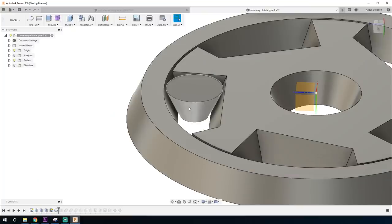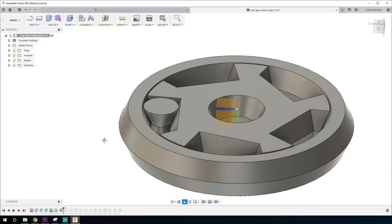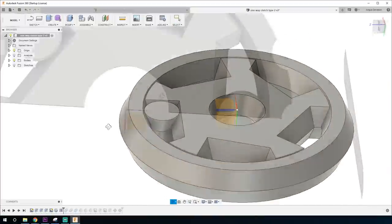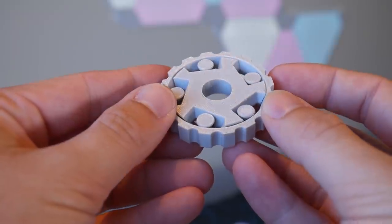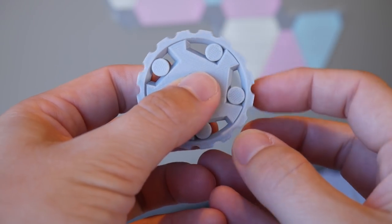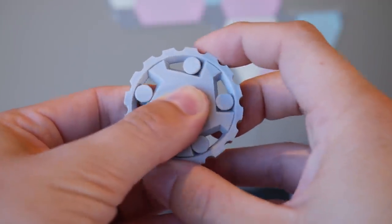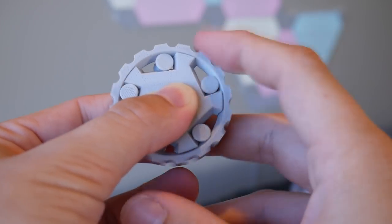How do we make rollers that don't spin around in the available space using FDM tolerances? I thought: what if I put a taper on both surfaces so the roller would no longer be a cylinder, but like two cones facing each other, with the outside rails meeting those. It can't spin around in its socket but it can still move back and forth on the rail. I did a test and it works better than I could have imagined. It's only eight millimeters thick. This rotates really cleanly in one direction, but in the other it instantly binds up. Straight away.